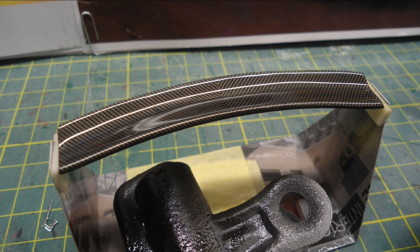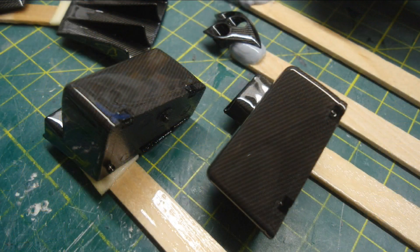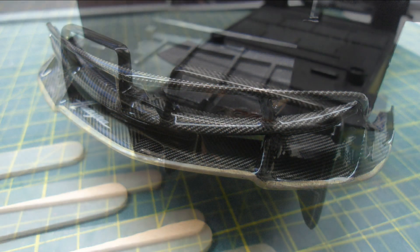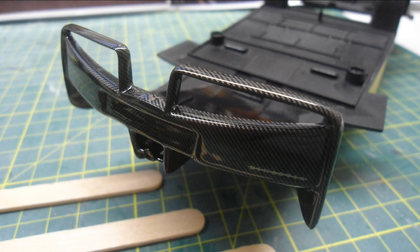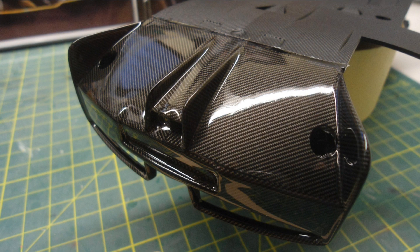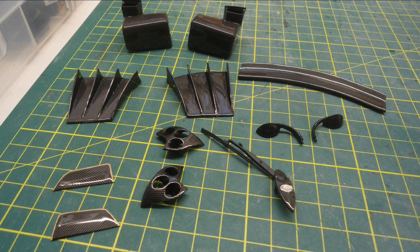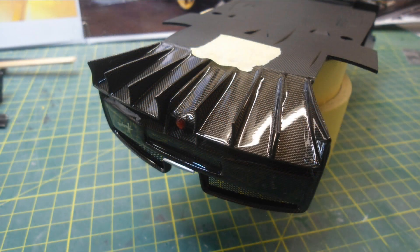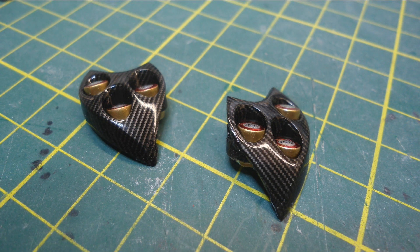I really lay on the clear to get that sort of brilliant finish. Just re-cleared the factory side luggage boxes as they didn't need to be carbon fibre decaled, and here's the front and rear all clear coated - super glossy, which is the bonus of using a 2K clear on these models. All the little parts will be set to the side while they dry, and then I can start assembling - gluing the mesh in, gluing the rain light in, rear diffuser just sitting in there at this stage.